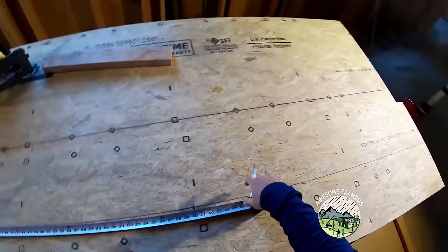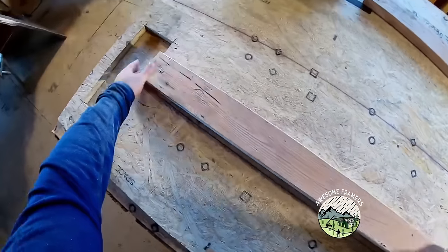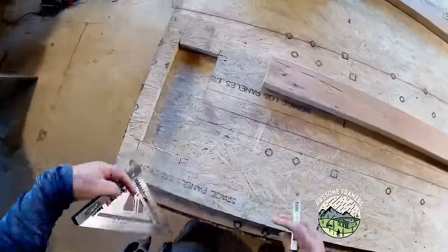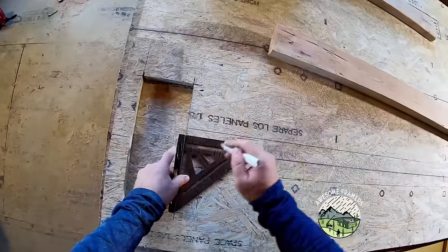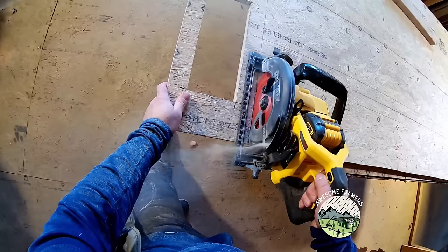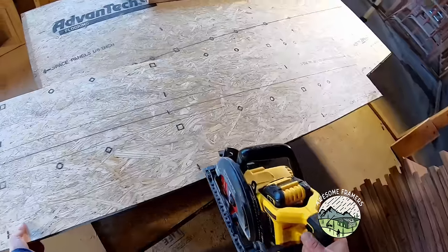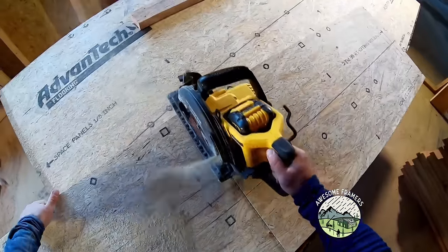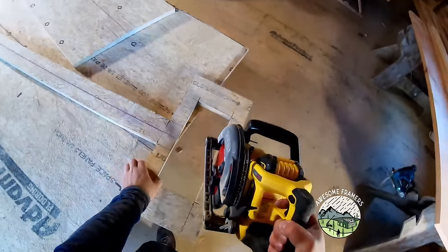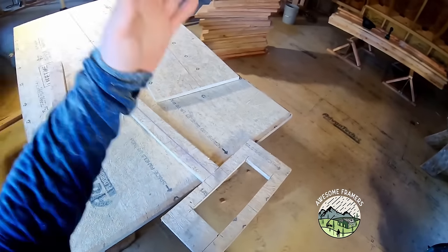About 40 inches — I'll go there. Inch and three quarters. There's the trammel arm. It's going to fit in just like that, and essentially I'm going to pin everything down so that all I have to do is walk each one and make the radius.